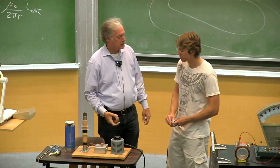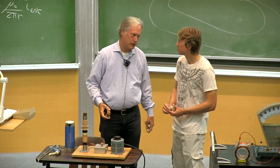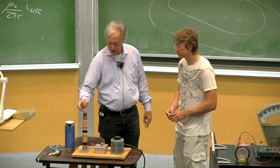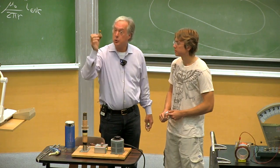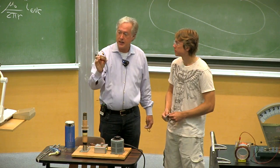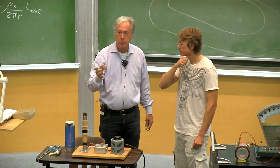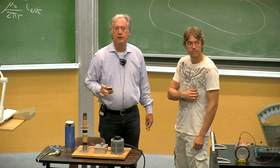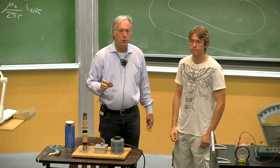The frequency, what'd that sound like? 60 cycles, same as that transformer? Kind of in the same ballpark? About the same, maybe exactly the same, right? Different harmonics because the structure of this thing's a little different. So what we found then, again, changing magnetic flux for sure is driving current because current is what lights the light bulb. That heated the light bulb up, caused it to emit black body radiation, and we saw the light bulb lit up, so we know there's current. Now we've proved it. What makes electric currents? Moving charges. What moves charges?